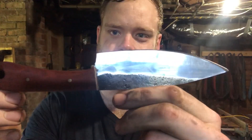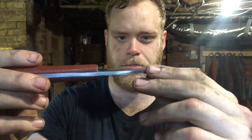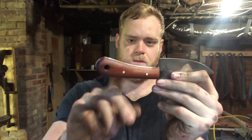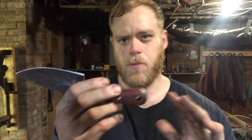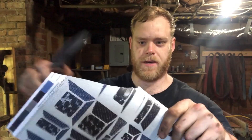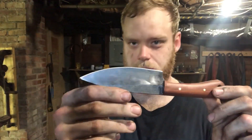Here's the finished knife. Still need to polish it a little more — there are smudges all over the grind. It's almost a perfect mirror; not perfect, but pretty close. Went with some bloodwood for the handle — full tang construction. Bloodwood's a great choice for a skinning knife: one, because it's red so blood's not going to stain it, and two, because it's very naturally dense, oily, and rot resistant. Put a lanyard hole on it because it's really useful — especially if it's cold out and you're skinning a deer or large animal, sometimes you have to grab the hide and pull with both hands. This way you can just hang the knife off your pinky without having to stick it in a tree or the ground and dull the blade. The hollow grind was a pretty serious learning curve because I'd never done it before, but it produces a very thin, very sharp edge — ideal for cutting soft tissue.